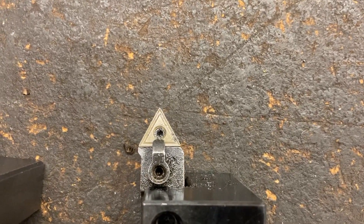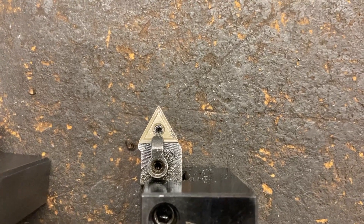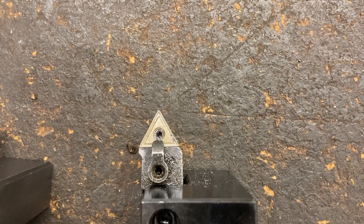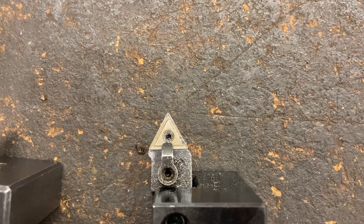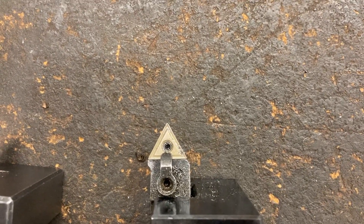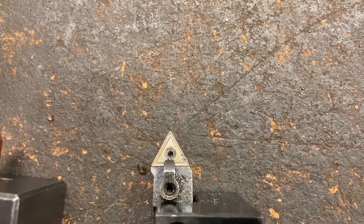I've never used this tool before — it's not my usual go-to. But I was looking for something to cut that V profile and this one is perfect. You can go in there, cut that angle, it's got clearance on the tool so it doesn't rub, and it's got a nice little radius at the tip. Works beautifully. We'll show you that in a little bit.